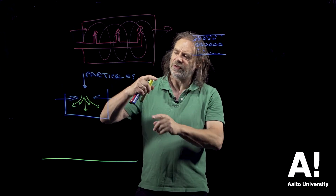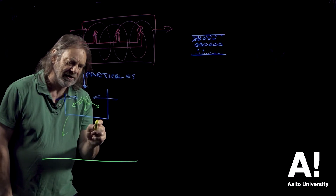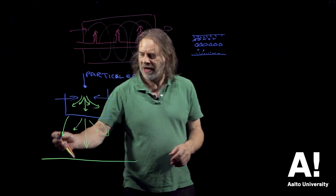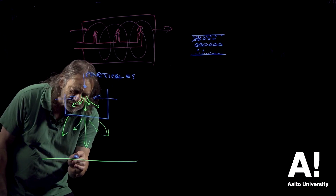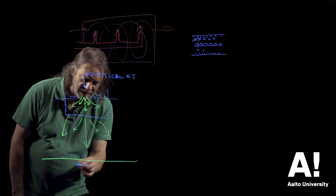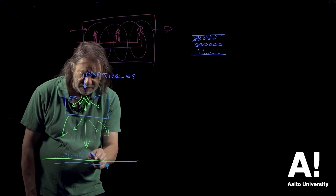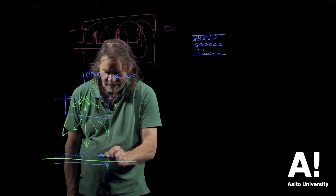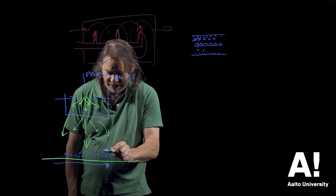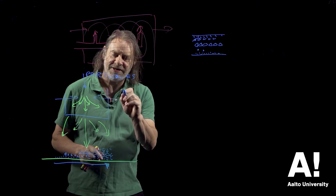There's a fair bit of subtlety going on. With this arrangement, small stuff drops to the sides, big stuff drops straight down, and middle-sized stuff drops in between. These particles land on the board first — the big stuff lands first, then as the board moves forward the medium-sized ones land on top, and finally the little ones land on the outside. This device is called a forming station, and this type uses an air classification system.